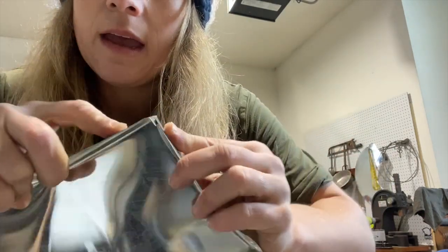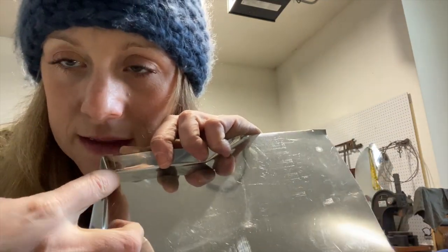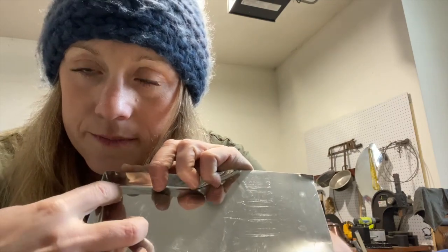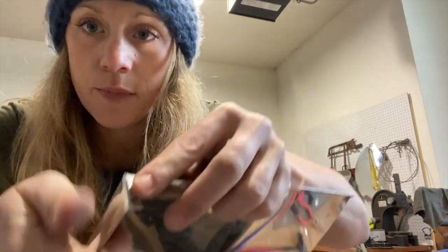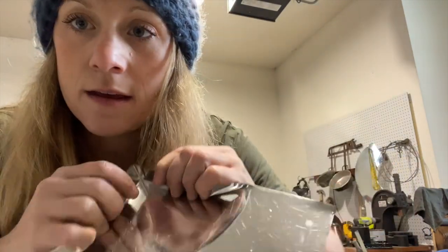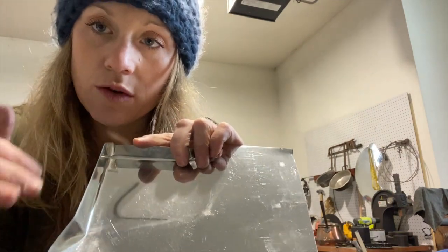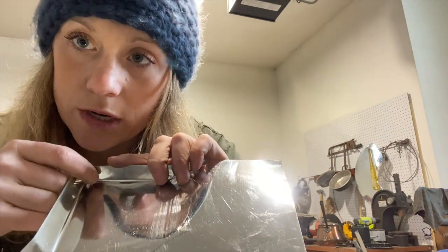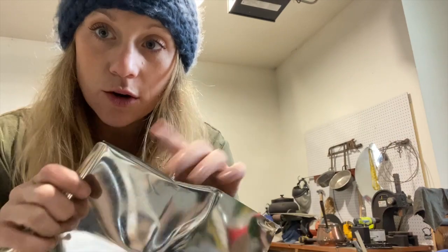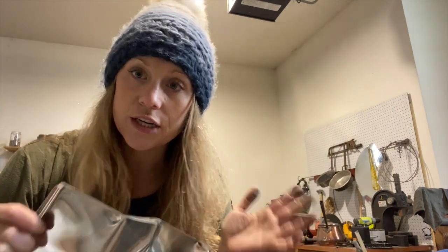And here it is on the inside. You can see the tab and why we had to have just a tiny little jag so that it didn't have a problem with the crease right there. So you can solder both. I would solder both the outside, and definitely if you're not tinning and you're just using a regular copper sheet or tin sheet and you're not tinning the inside, you're going to have to solder this whole corner as well. Okay, so two kinds of corner seams. One is seamless, one has seams. They both have their own issues.